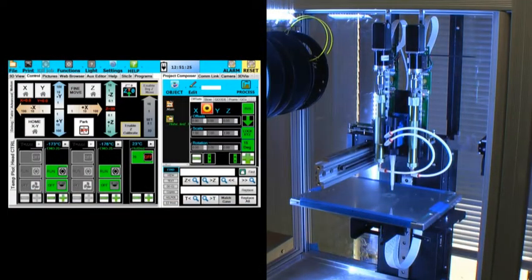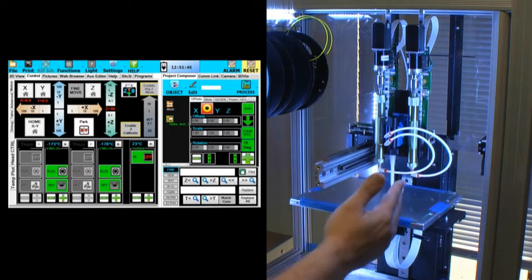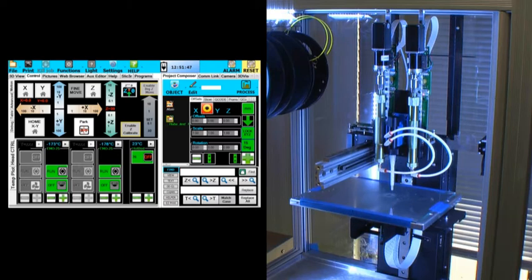In this video, we're going to show you how the Hyrel3D static mixing head, or SMH2, actually works. So there's some misconception. Some people think that it's got to be a static ratio. We have a different head for static ratios. With this head, you can either give a 50-50 blend, or you can do anything from 1% to 99%. You can dial in the ratios from each of your heads.